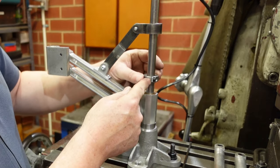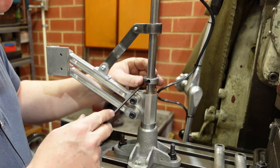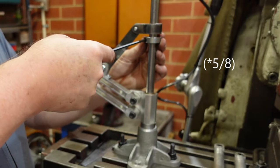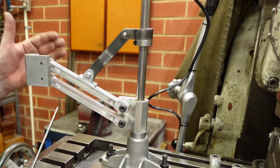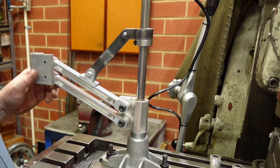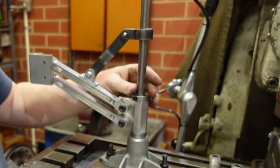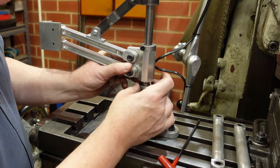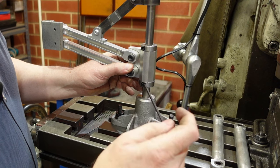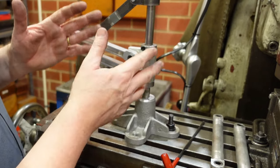I made up these collars - they're very similar to Taylor Hobson collars. The slot is slightly offset; when I cut the slot they sprang in a bit, but I was able to take them back out to the three-eighths size and they just sit in there and tighten up. Now this won't go further down than that, which is useful if you've got something tall and don't want the arm crashing down. It goes up freely but comes down to that stop. I've also put another collar down here so if you don't want it going further down you can tighten that one up.